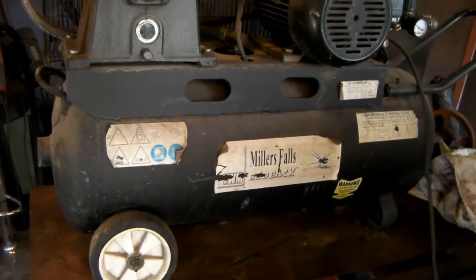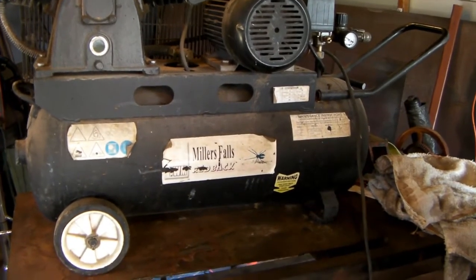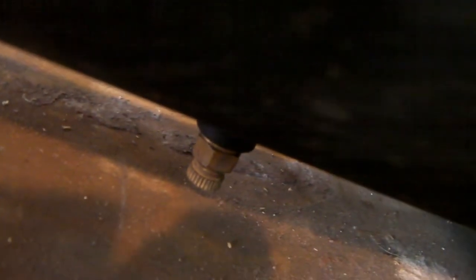As you can see I've got my compressor on my workbench. We'll go and find the drain bung and have a look at it. What you need to do is go to the very bottom of your tank — it doesn't matter what compressor you've got, it'll be on the bottom. There it is — there's the drain bung. Take notice of this because you can ruin a perfectly good air tank by not doing it. It's a pain to change and it's expensive for no reason, just because you didn't empty this little valve.